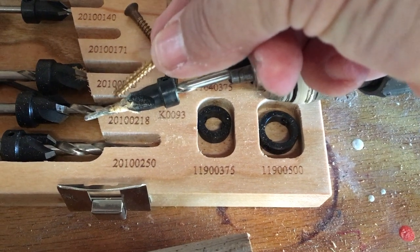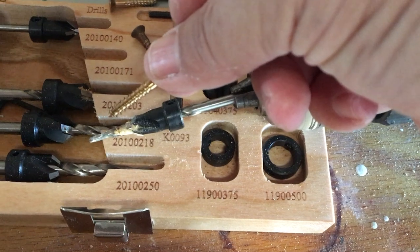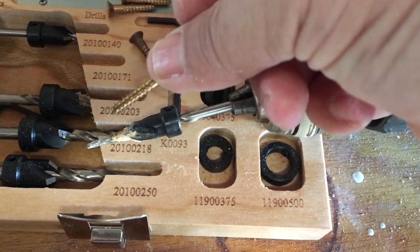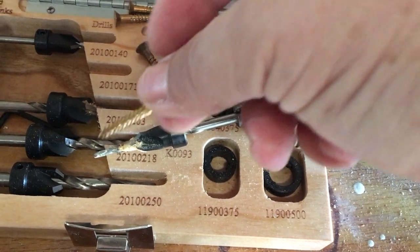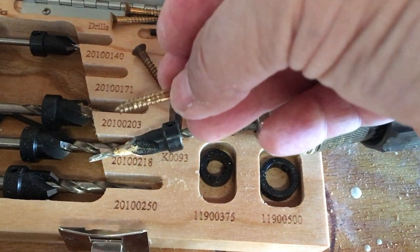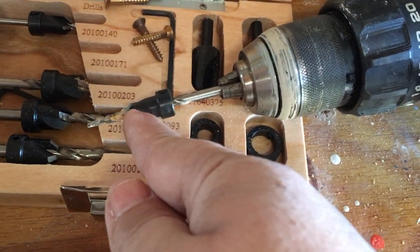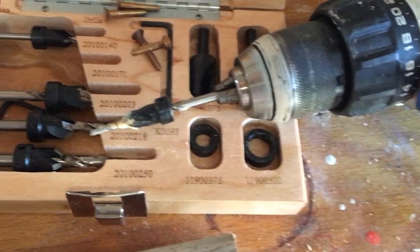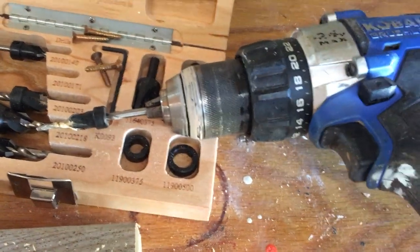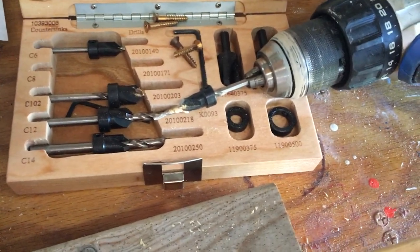Nowadays, experts at Wooden Boat Small Boats Monthly pointed out that the little center part of the shank and the threads are all one size — it doesn't taper like they used to. So there is also a pilot bit: one size for the shank of the screw and then another size for the root where the threads are. You can order those from Fuller if it's that critical — if you're going into a hardwood like oak. We're going into mahogany, so it's not too bad.